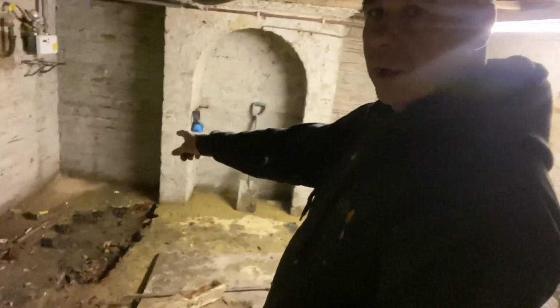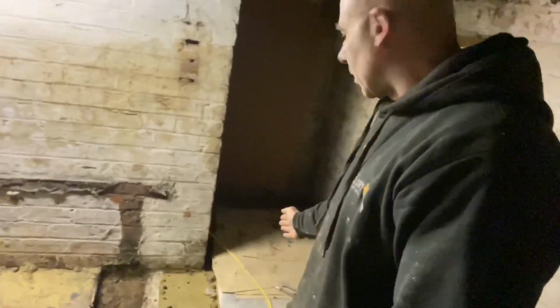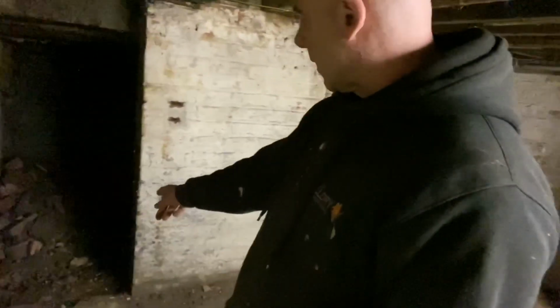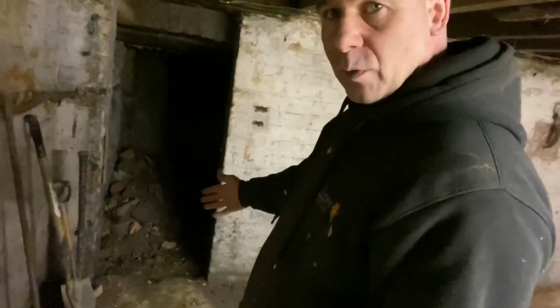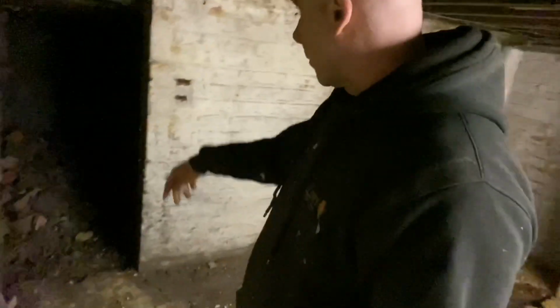I'm going to come across the front pillars, down this wall, a branch off into there, down that wall. And I've been contemplating just popping a branch in. Well, I'm not going to. If any water comes up in there, it'll come through the wall-floor angle. If I put a drain across there, it'll drop into the drain.